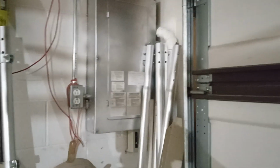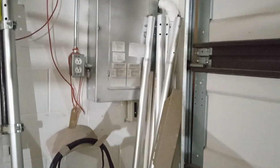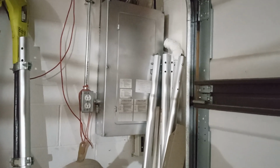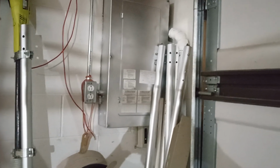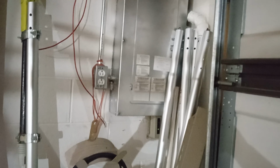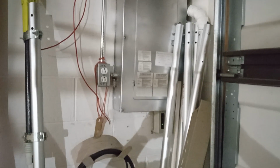And here's a service entrance to my house. It's the breaker box. Well, there's a cable in there, the bare one. It goes up to the weatherhead. There's a number 6 wire coming down to the ground rod. It's forbidden by code to put another ground rod over on the other end of the house and pretend that somehow that's a ground rod as part of this system, because they're too far apart to be bonded.